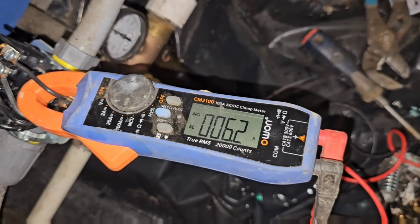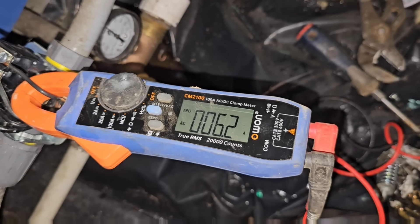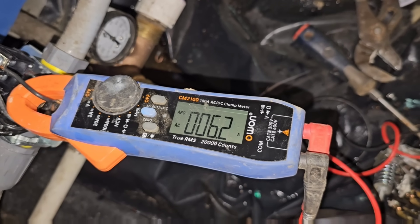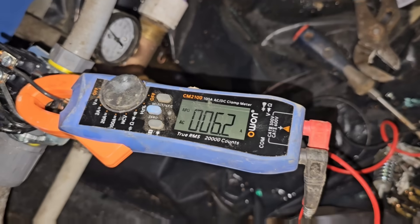What was probably happening is the switch was fried and wasn't giving a reliable connection, so it kept flickering the pump on and off — on, off, on, off — and it made it stick in that start phase.